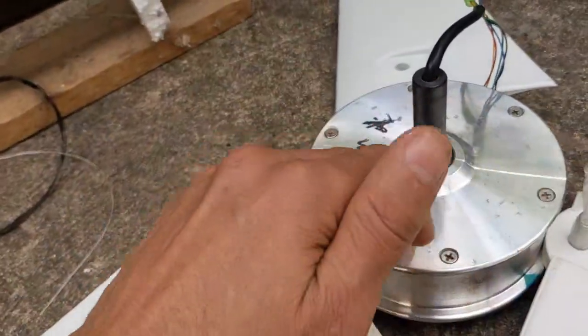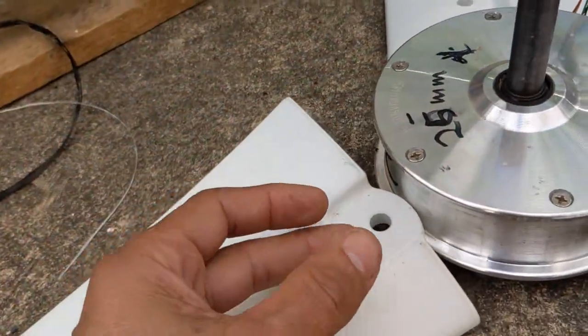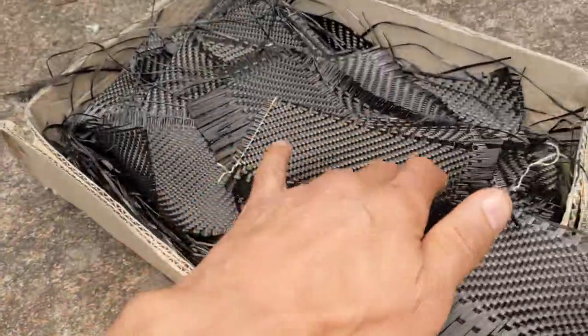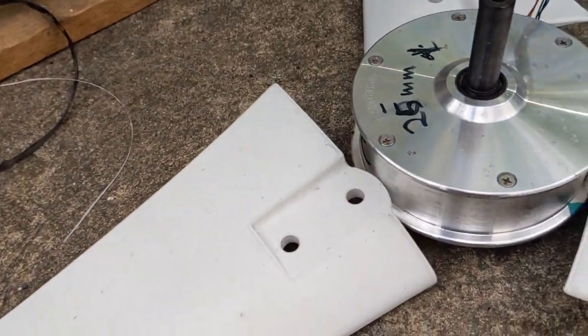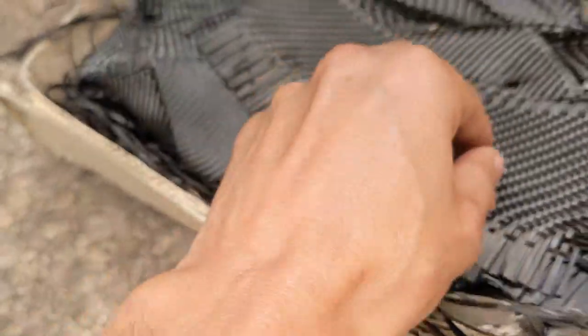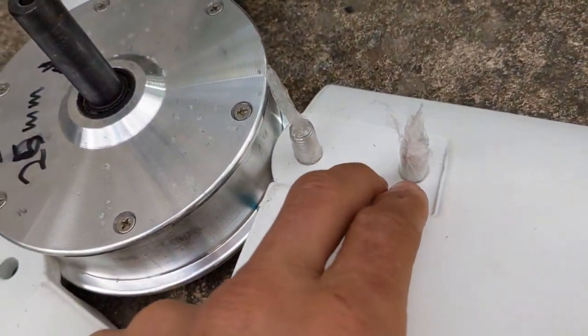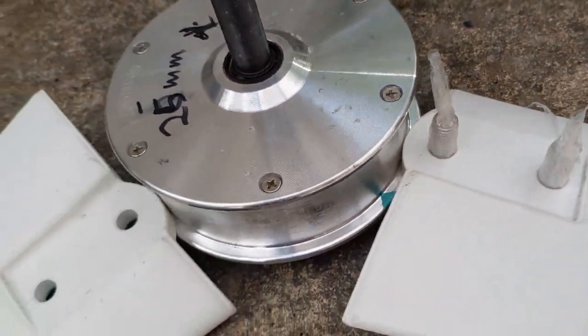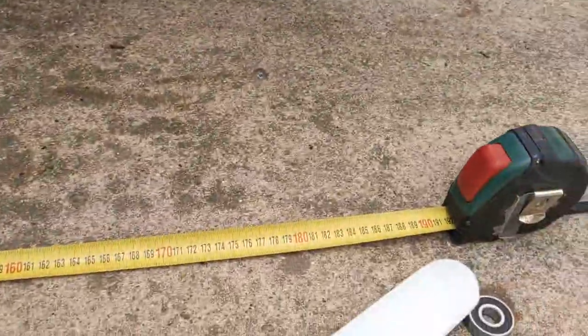You could save layers by connecting them on the opposite side to the front for more stability — a sheet on the back and front — but that requires two epoxy curing steps. I think it's better to just do ten layers of carbon, basalt, or glass fiber. If you put a sheet over the holes it won't be perfectly flat, so you also need the fiber to really make the screw hold very tight.